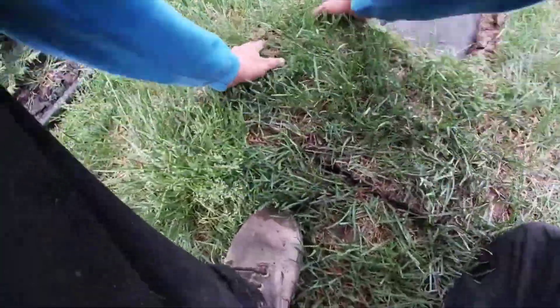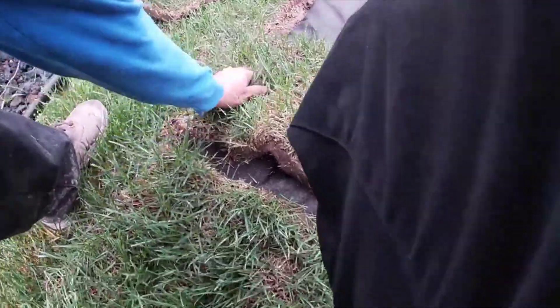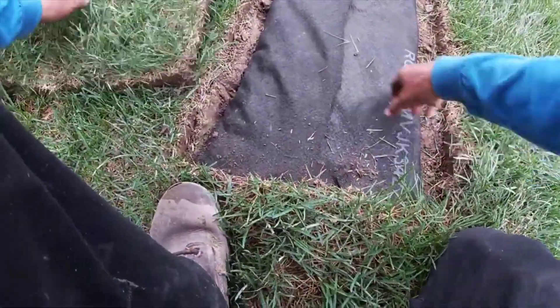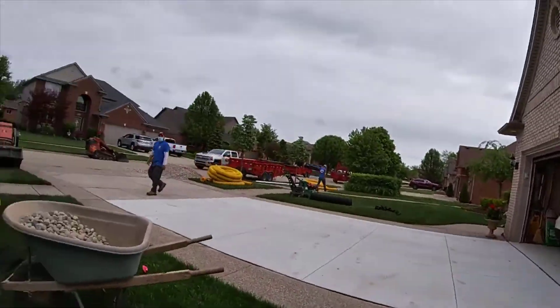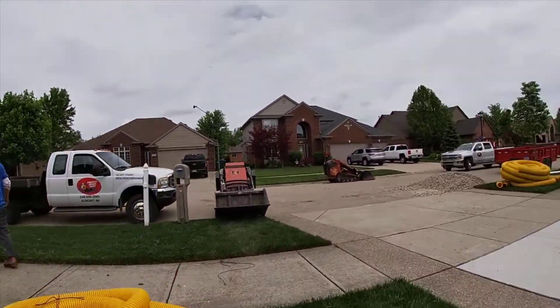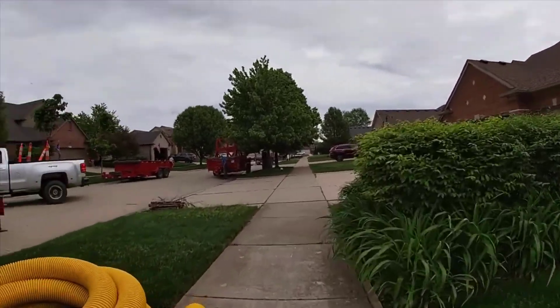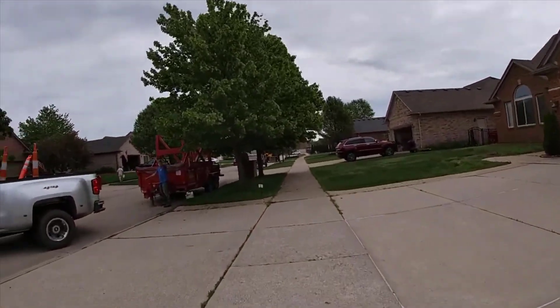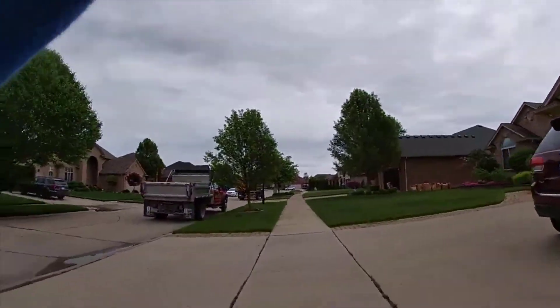When cutting your sod, we use a special sod cutter — not one rental companies carry. Ours costs $5,000 and can cut sod three or four inches depending on the situation. In this case we had sprinklers, so we cut three inches; without sprinklers we would cut four inches. There's also a limit to how much dirt you can put on top of your French drain system, because roots will only penetrate about five inches in the north where we have bluegrass. You need that root penetration into your fabric to have a great French drain system.